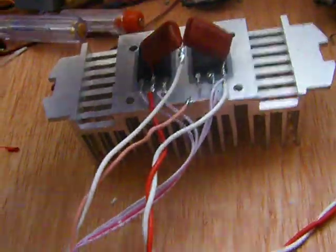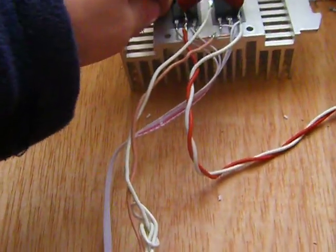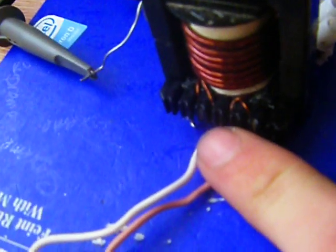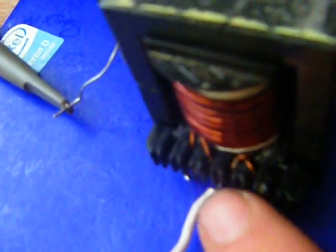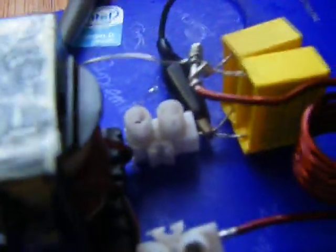Here's a new half-bridge I made: one microfarad capacitors, an IRF-P450A. The output goes to a transformer — homemade — with seven turns of secondary, 20 turns of primary, center tap, but I'm currently on 10 turns. One microfarad capacitor and 0.68 microfarad capacitor.